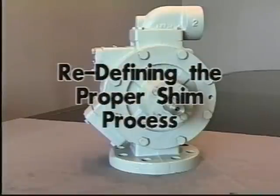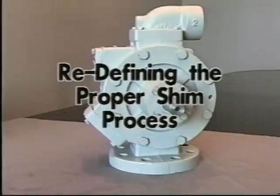To define the proper shimming of a new pump, you begin with the first side by tightening the bearing cap down by hand, checking the clearance between the bearing cap and the head, whatever that clearance is, adding a total of 6 thousandths more. Going to the second side, tightening the bearing cap down by hand, checking the clearance and installing a total of 2 thousandths more.